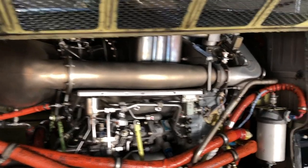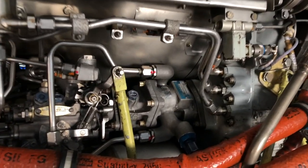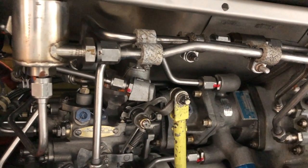The fuel control is here, and as mentioned before, it speaks to the governor with hard pressure lines. The fuel control is kind of like the throttle — the pilot doesn't have to manually adjust the throttle in this helicopter; it's done automatically by this unit. It dictates how much fuel is going back into the combustion section of the engine.